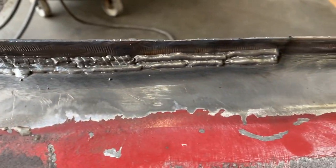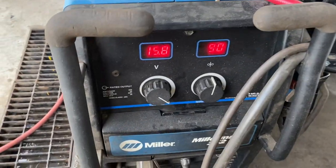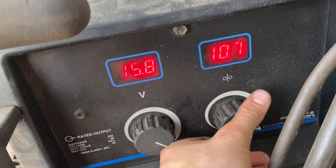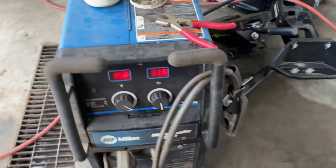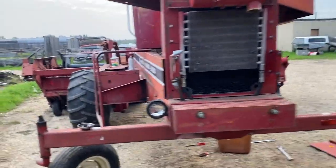It's 18-gauge steel per side of the tank - two edges pinched together and welded, and it cracked on the inside of the tank wall. I was welding at 15.8 volts and 120 inches per minute wire feed, then backed it down to 90 - that worked pretty well. No other leaks around the edges. Since I didn't have any red paint I just hit it with gloss black to seal the welds from rusting. I've got it draining out the bottom overnight.